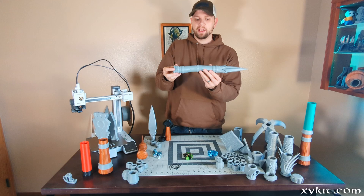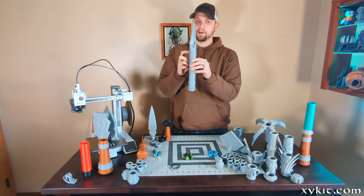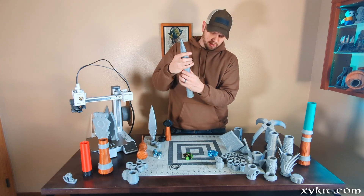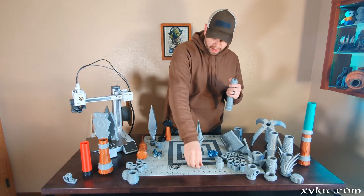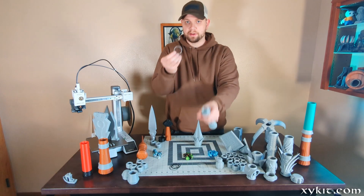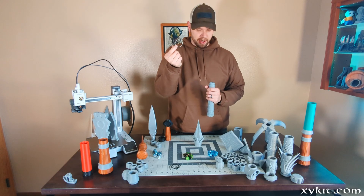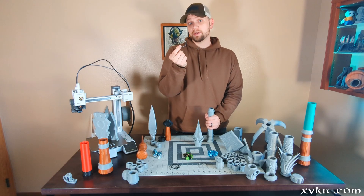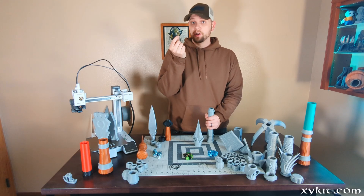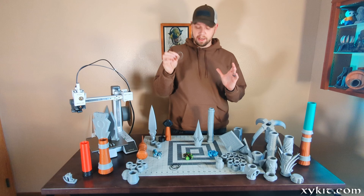This one doesn't quite line up where I want it to be. So how do you correct that with different tightnesses of screws? There's a very simple way. We have made a series of washers that can be 3D printed, and these will stop the screw at the right spot. They go from 0.1 millimeters all the way up to two millimeters thick, depending on what your tolerances are for your printer and how many items you're trying to get to line up at once.